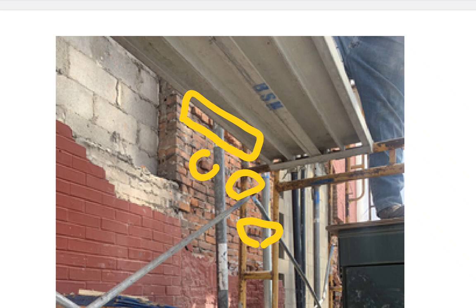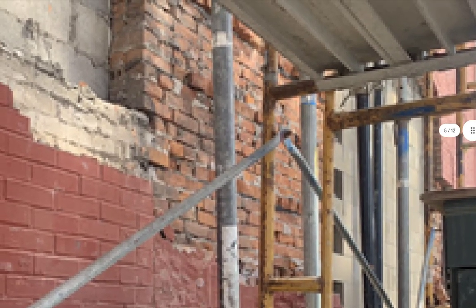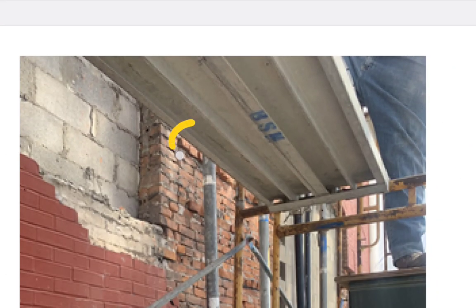But I told you that could be the reason. It's just kind of random. That's not like this course here. Unless they took a BFH, a big hammer, and these were sticking out, and they said, just clean that up, and they cleaned it off to make it straight, which means now you're losing your ties. But I would see fractures in the brick, and then the debris on the ground, to determine if that's what they're doing here. I can't tell. It pixelates too much when we get in there. But we do have no mortar on the face of these bricks.